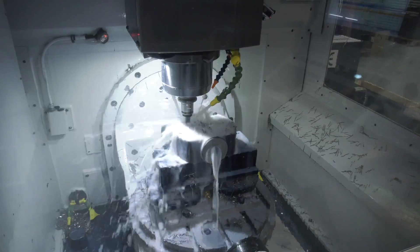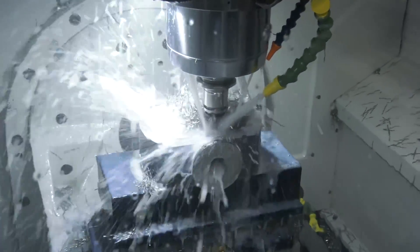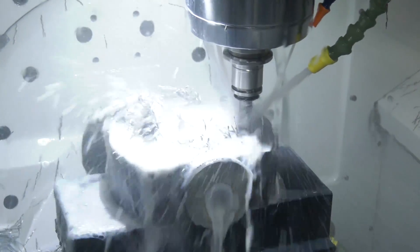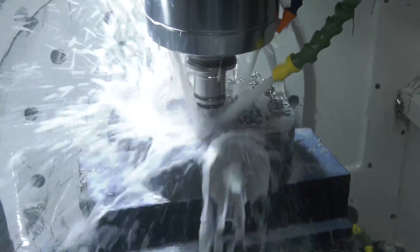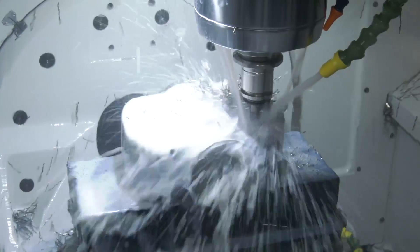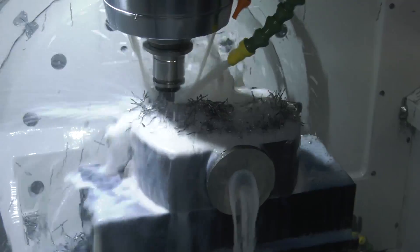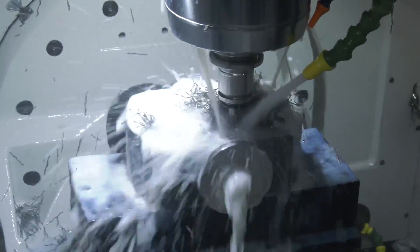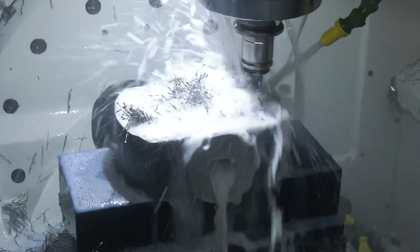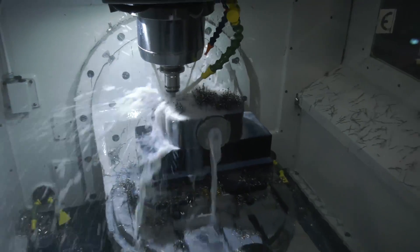There's a 16mm end mill in there. It's doing 1mm incremental cuts, getting wider and wider at increments of 1mm. This is a 30mm cut. The cutting tool is a 16mm MA4 end mill. This will rough out everything except the front face, which the face mill does. It also does the interpolation on the end ports — once it finishes here, it'll turn around, do one port, then turn over and do the other port.